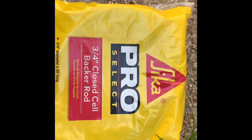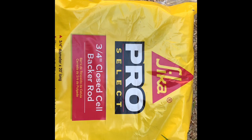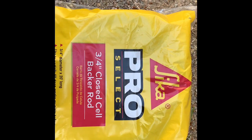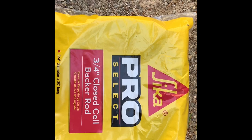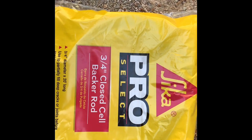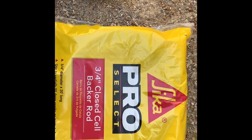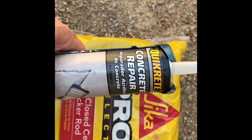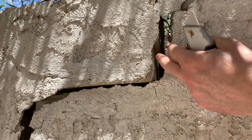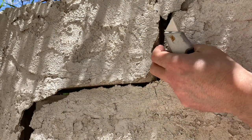For the largest parts of this crack I'm gonna stuff it with some backer rod. The directions on the label say to fill the gap up to a maximum of three-eighths of an inch deep. I'm gonna try to get it to a quarter inch, then put the concrete repair in there, let that harden, and then paint it. I'll start stuffing the backer rod in there now.